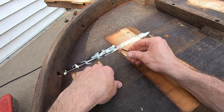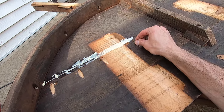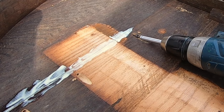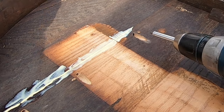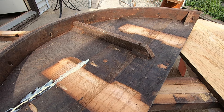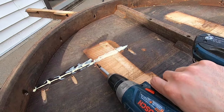These are not regular screws — they're pocket hole screws, made to pull joints together tight. You can see the glue squirt out as I tighten the screws; that's a great sign that it's working. So don't cheap out and use screws you have on hand — spend the extra money for real pocket hole screws.